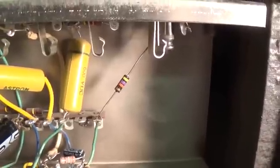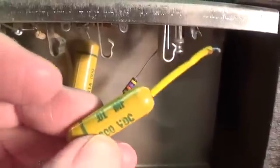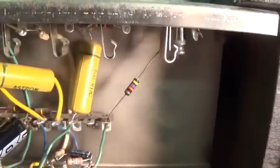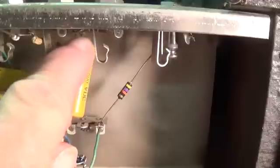And finally, to give the microphone input the same impedance as the instrument inputs — they had it coming in through a .01 microfarad capacitor with no impedance — I changed it so it has exactly the same impedance as the three instrument inputs.